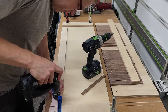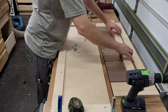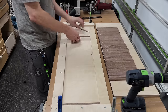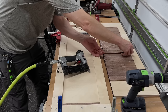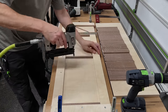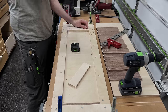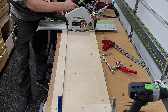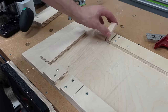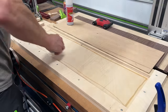I'm using some Baltic birch plywood to make the jig. I clamped a big piece down, ripped up some strips, and screwed those down. I need to make sure this jig is perfectly square so the tambour strips don't skew sideways. I also want the top and bottom rail to be the exact distance to match the height of all the tambour strips. I'm using a square to make sure nothing is crooked, tacking it in place and screwing it down. I'm also adding stop blocks at the end equal to the length of the tambour. Then I'm cutting right into the jig — pulling out a couple pieces top and bottom, which will allow me to slide in some wedges and wedge the entire assembly nice and tight.